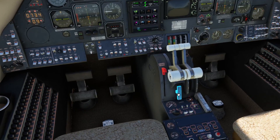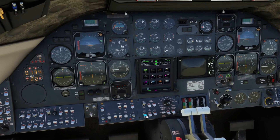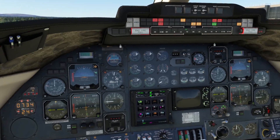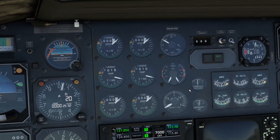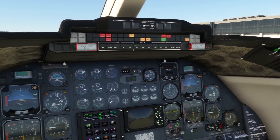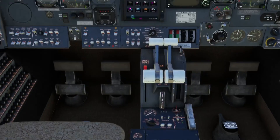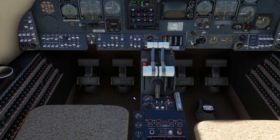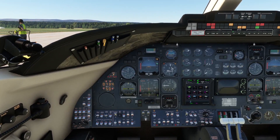There's no hydraulic pressure at the minute, so if you see me trying to activate the parking brake it won't work because there's no hydraulic pressure. We can resolve that by turning on the hydraulic pump, and we will now see we've got hydraulic pressure — looking at about 125, which is normal — and if we come across to the glare shield we'll see that the low hydraulic pressure light has extinguished and we can now actuate the parking brake.